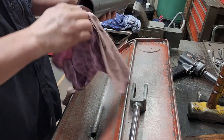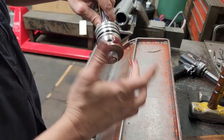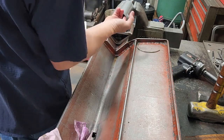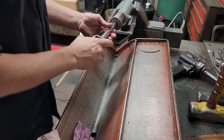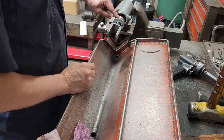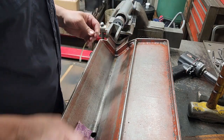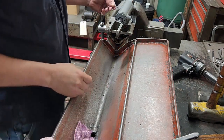Once that's run tight, set this to the side. Inspect and make sure your tube is fine — this looks pretty good. I'll put it back in the vise. I'll take some grease and grease up the piston seal and the o-ring on the gland, then put a little grease inside the tube as well. Now we're ready to put the rod back in — I'll start the piston and that thing just went right in. Remember the gland has a hole in it for the lock ring to locate in, and that's what turns the ring in as we turn the gland. This hole needs to be in line with the slot. Push the gland in, take our lock ring, and locate it.